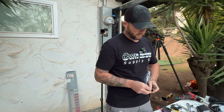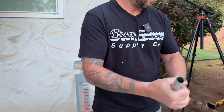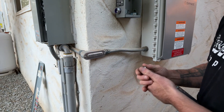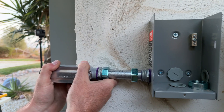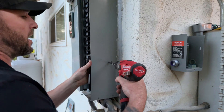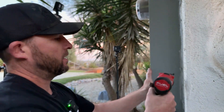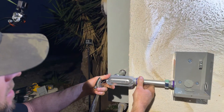You're going to put your collar over your piece of EMT, slide the EMT in, have your collar on, get the nut on, and tighten it down. Coming to this one, we're going to put our collar on first, then put our compression seal on next. We'll slide this in - that's going to give us the correct spacing we need off the wall and we'll determine exactly where we need to drill the hole in the side of the box. Now that we have our spot marked, make sure all the wires are moved inside before drilling. We'll use a step bit and get this to three-quarters inch.